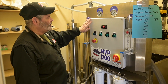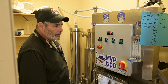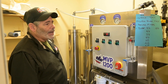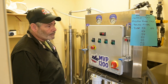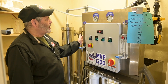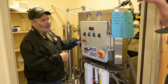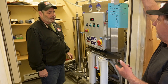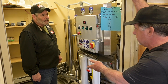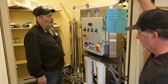We test-fired one of your single membrane MVPs the year before, and that worked out well. You said you wanted to order this one a little bigger because you wanted to increase the number of taps. We've been processing close to 900 to 1,000 gallons an hour at 12 to 14 percent — no complaints whatsoever. We bought a machine a little bigger than what we need, but it allows us to do the cleaning process when we really need to. We also bought the big 1,500-gallon holding tank for permeate, which Sean suggested.